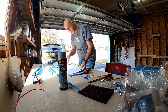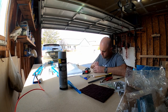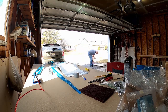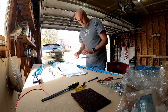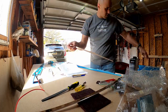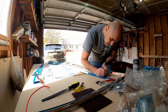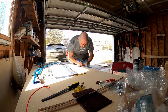In this case I'm also scuffing some of the parts for a self-etching primer to adhere to. The reason for that is, in the tail pieces specifically, there aren't very many ways to inspect the parts after you've assembled it. So I want to prime the areas where metal will meet metal to give it that extra protective coating from corrosion — even though this is all clad aluminum, which has about five percent of its thickness as pure aluminum, forming a nice corrosion-protective aluminum oxide on it.